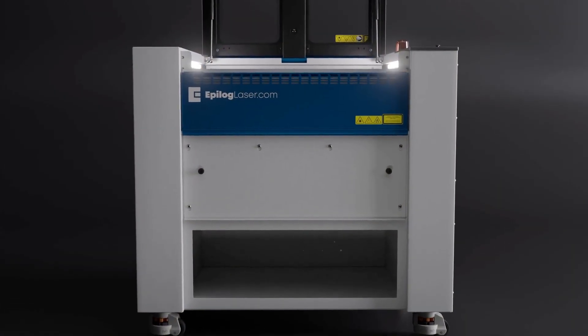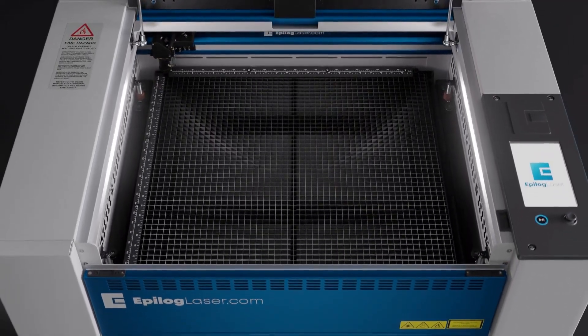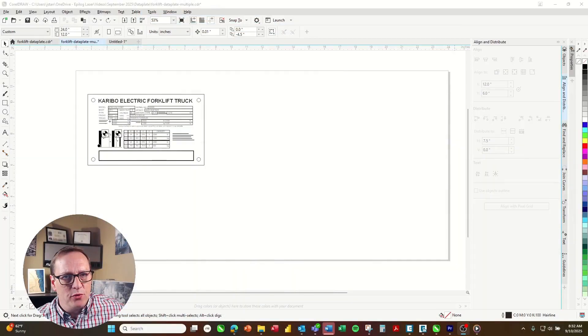We're going to start out by looking at our flatbed CO2 lasers for engraving anodized aluminum. Anodized aluminum engraves really well with a CO2 laser because the CO2 laser is really bleaching that anodized layer — so you're not affecting the aluminum, and you get that bleached, really white mark on the colored engraving. You can set these up in any type of design software you want. We're in CorelDRAW here, but Illustrator, Bartender, and AutoCAD all work. It's very simple to do.